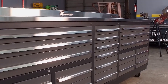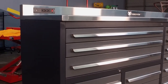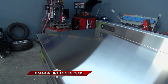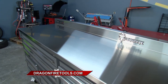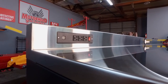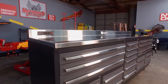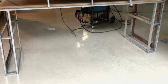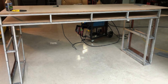So how tough is it and how is this made? This entire workbench weighs in at over 1,200 pounds. The whole thing is welded steel — it's not separate pieces, it's all one piece put together. This top is one contiguous piece of 304 14-gauge stainless steel with the ends corner welded. The drawer bodies are 16-gauge galvanized steel, the drawer pulls are 14-gauge stainless steel just like the top, and the entire thing has a 14-gauge tubular steel frame. Overbuilt, built to last.